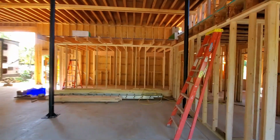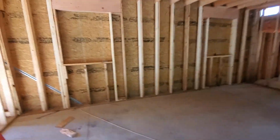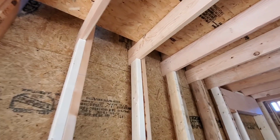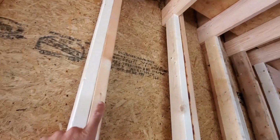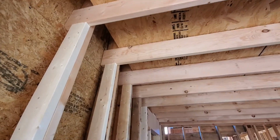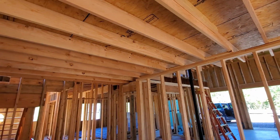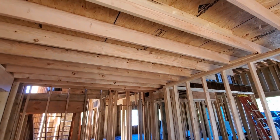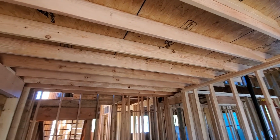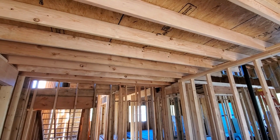And we have the 2x6s, and then we scabbed in a 2x4 stud on the side. So my floor joists are nailed into the 2x6, and then we added a 2x4 to the side that it's resting on. So my batteries are going to line up along this wall. So there's no doubt in my mind that it'll support the weight. This ceiling is going to have some flex to it. So my idea is that after it is foamed, I will put the pine across the top and stain it. So that with the white cabinets, that'll look pretty sharp, I think.